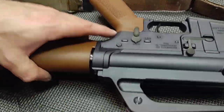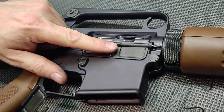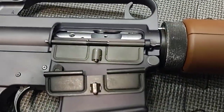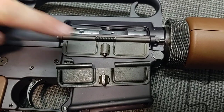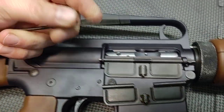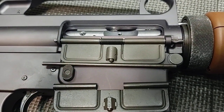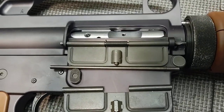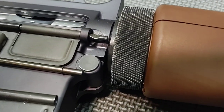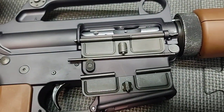The last external modification was part of the dust cover. This is a reproduction dust cover — it does look different than the one Brownells includes. The original prototype had a roll pin that shot through the mechanism here. We also replaced the dust cover rod — they used a C-clip on it just like most AR-15s and M16s do, but if you look closely in the book they actually swaged the front of the dust cover rod, so there was no C-clip. It was just mashed flat so the rod would not come rearward out of the gun.